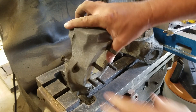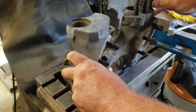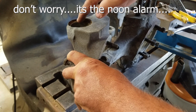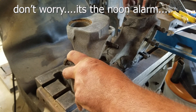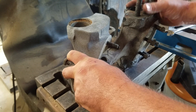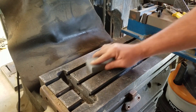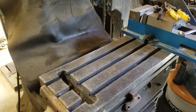In this episode we are going to be machining this top surface flat so that it is similar to this one here where it's got the three studs with the flat surface on it. This spot right here where the ball joint goes — that is my locating height. I've got the same thing right here, this ring right here, that's what I'm going to aim for for my height. I don't have to worry about any measuring; I can be maybe about 10 thou higher than this lip and I'll be good. There's really no precision needed for this surface.